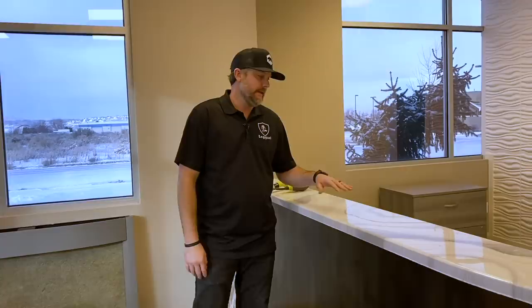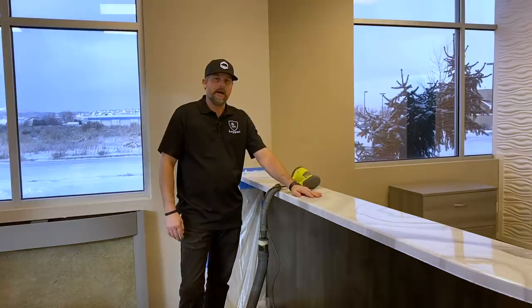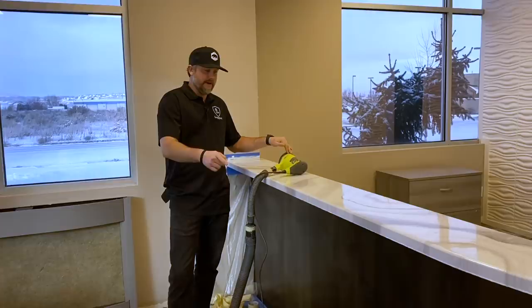But with our urethane, you want to make sure you're using 320 grit or 220 grit, something really fine that's not going to scuff it up a lot and make big scratches in it. So we're going to use a palm sander with 320 grit, then vacuum. We're just going to hit the whole counter. And then if you come over here,